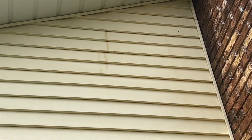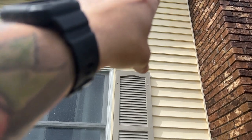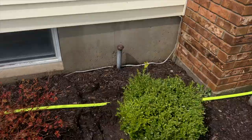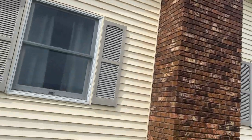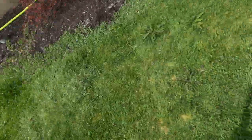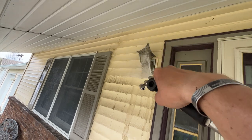If you ever see something like this, all that is is the weep holes in the siding. So you'd have a clean house after you washed it, but the water that gets behind the siding a little bit will drip through those weep holes — each piece of siding has them. So all you gotta do is when you're done washing and doing your walk-around, just keep your pressure washer on and hit it quick. It goes right away. Knock it right down.